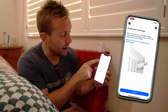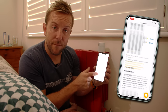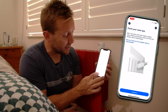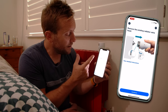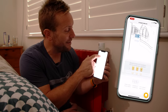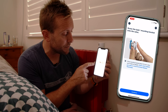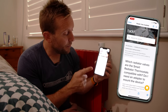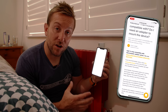The app lets you check your valve type and walks you through identifying whether your radiator valve is thermostatic. Tado helpfully covers all that information. There are instructions for many different head types — they've thought of all the different ones out there. Importantly, there's a button to check which adapter you need to mount the smart radiator thermostat. You can also access Tado's website article on this. If you have a really unusual valve type, you can buy extra mounts when you purchase your Tado valves.